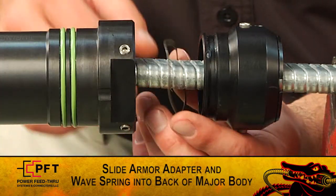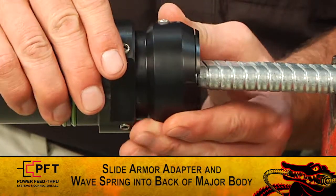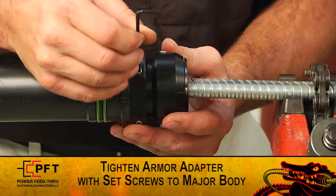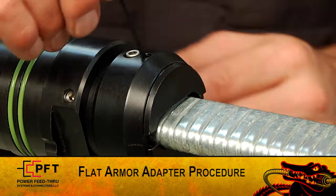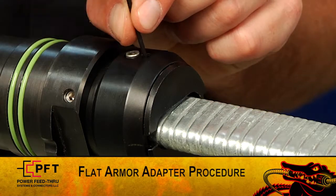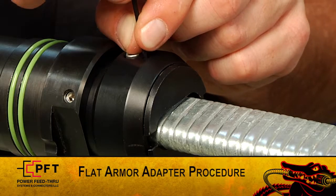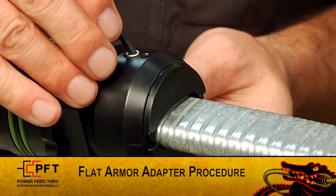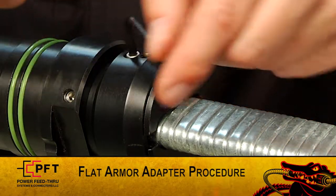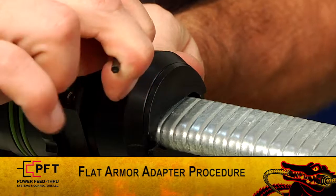Now you can slide the armor adapter and wave spring up into the back of the Gator Feed assembly and tighten with the set screws. When using a flat armor adapter, loosen the large cap screws. Using the 2 small set screws in the adapter, adjust both so they are equally spaced on the cable. Tighten the 2 small set screws until made up, and then lightly snug up the 2 large cap screws.